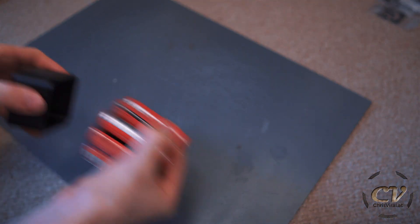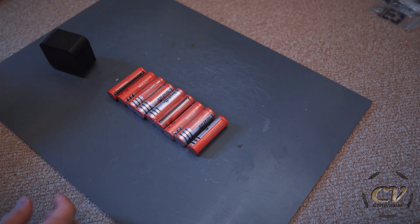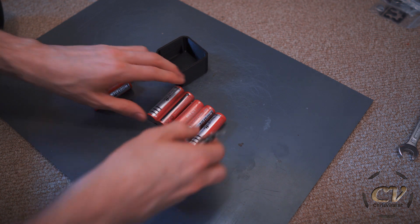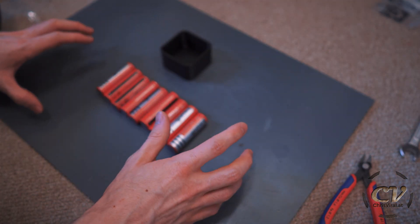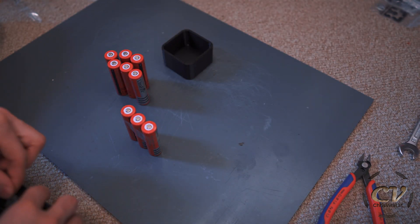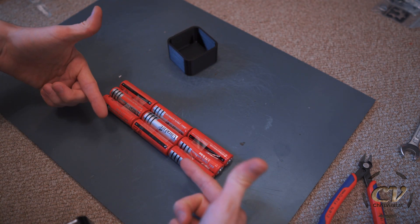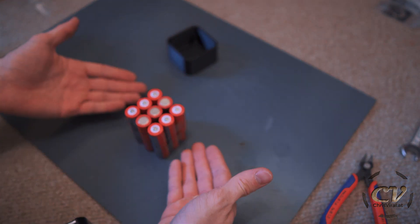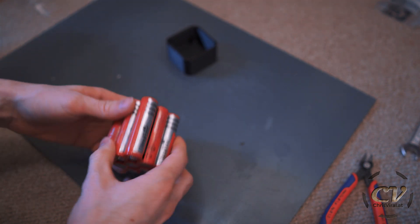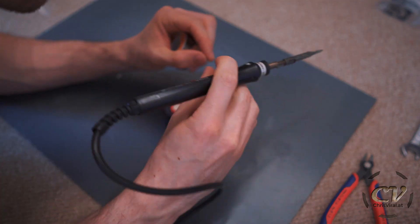Here we go. As you can see, I have nine of these Ultrafire 18650 batteries — one of them cost me around 90 cents, so that's pretty awesome. I already tried printing a case — it would have been a nine-hour print, but something made it stop. Now that I have them freed from their cage, let's wrap them again. I want to go for a 3P 3S power pack in this configuration, so I need three groups of three. Each stack will be wired in parallel, and then the three stacks will be wired in series. Wrapping it up like that is basically what I need. This should make soldering easier since it already has structural integrity — and it fits inside the box perfectly. Next up is soldering; just don't heat them up too much.